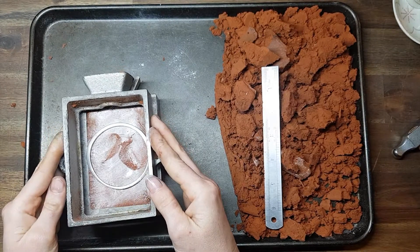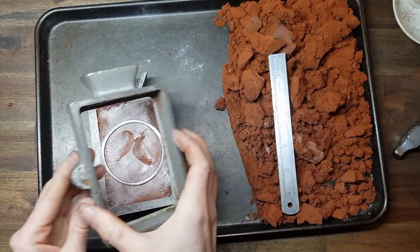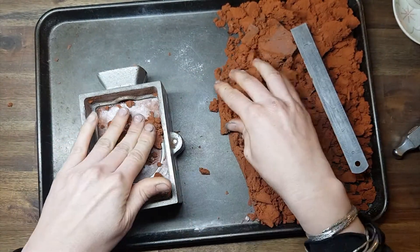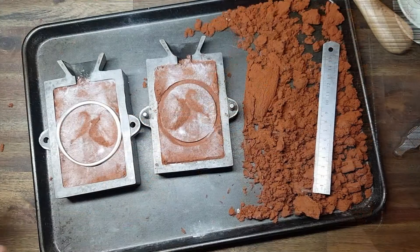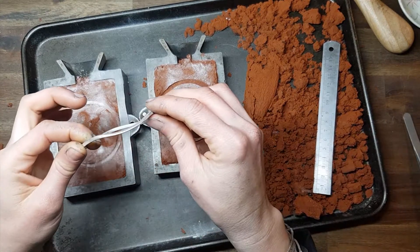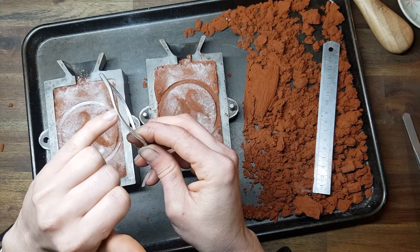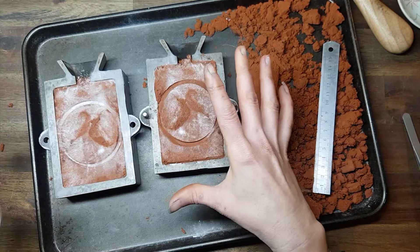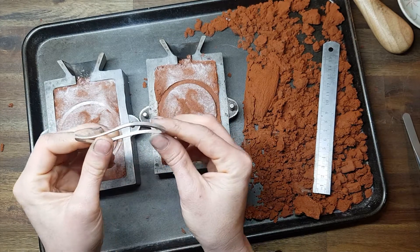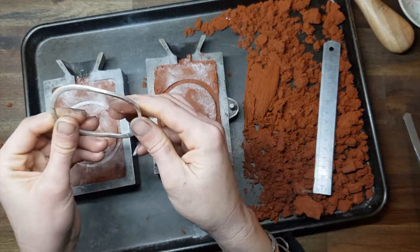Let's put the female on top — making sure it fits inside your flask. Get your object out. If you look at this bangle, it gets quite thin here and a little bit thinner in these spots. I'm particularly worried about this section — if I cast this bangle as an exact replica right now, I suspect the metal would cool down too quickly before filling the whole bangle and not form properly.